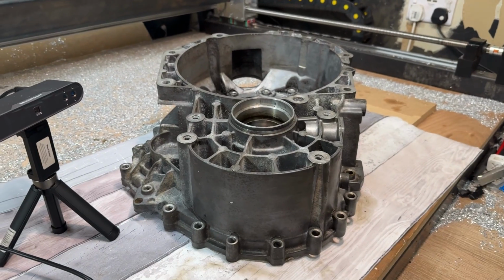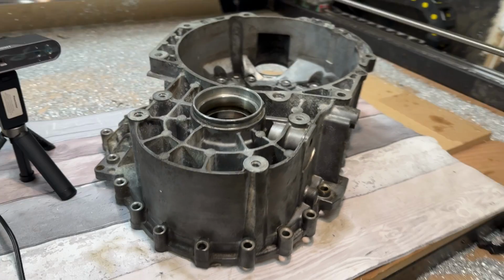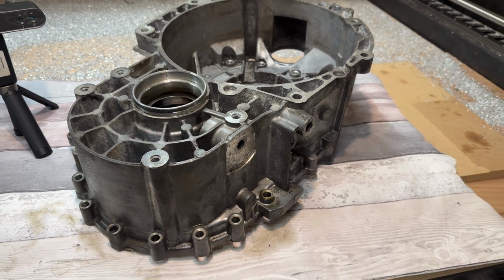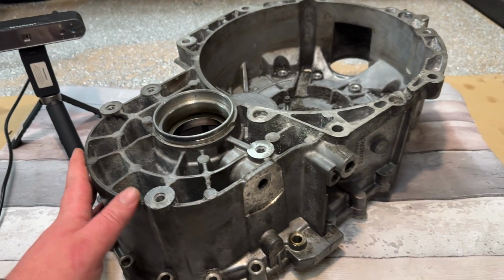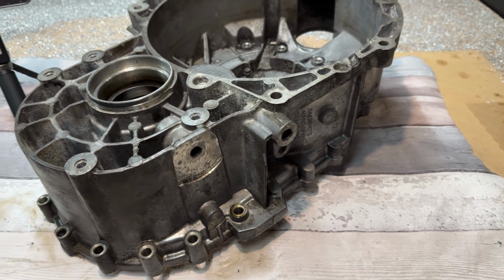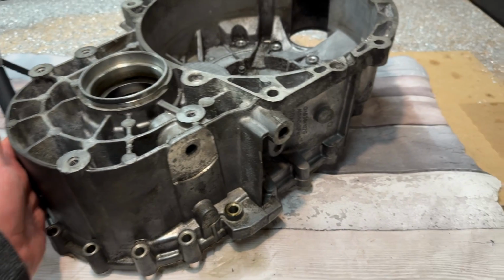He keeps killing O2M gearboxes, so that's the older 6-speed. He's up around 600 Newton meters of torque now and stripping 4th gear, so this is an upgrade. This family of gearbox they're used in most commonly TTRS, RS3, older Tiguan, TDIs.